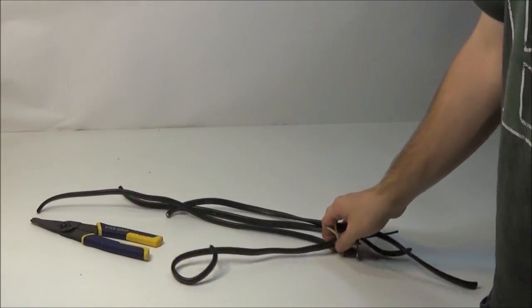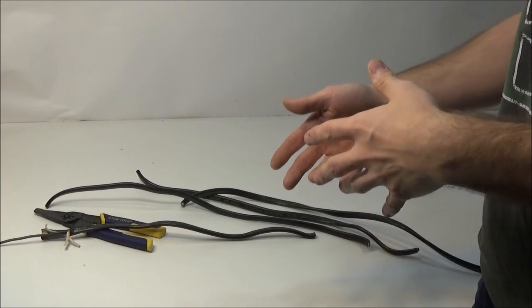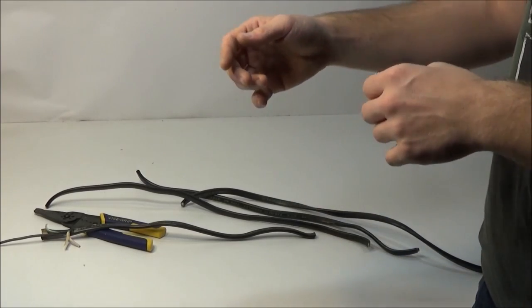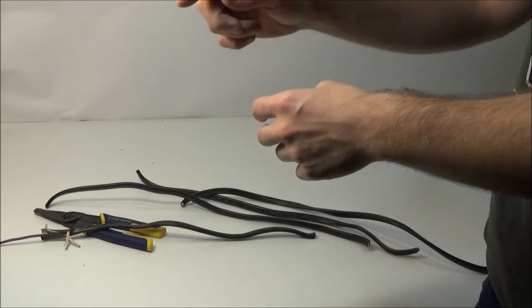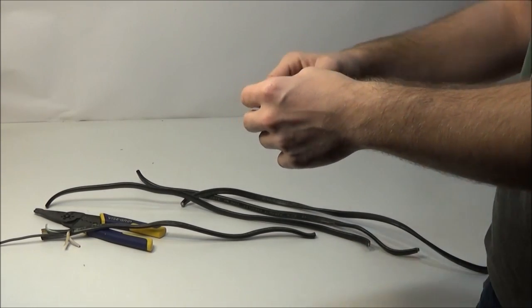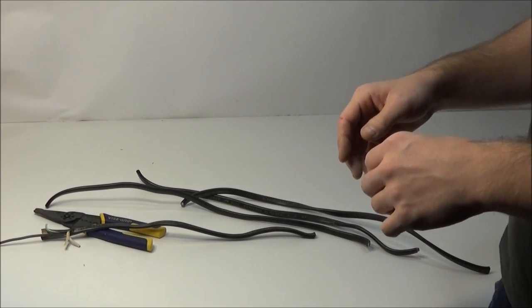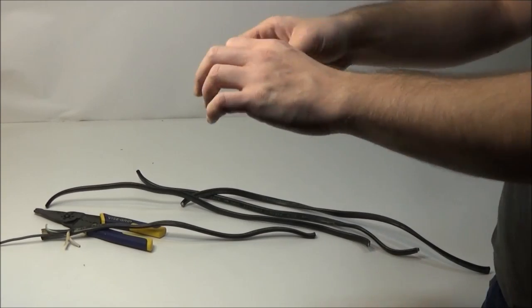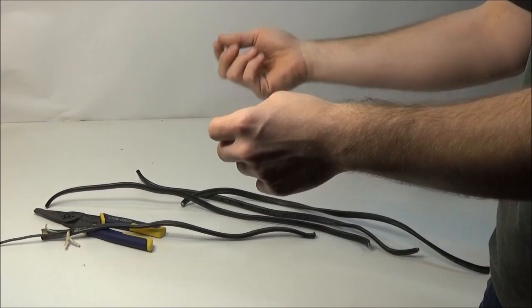Hey there YouTube. So yesterday I had to rewire a bunch of stuff. I was replacing switches and adding an outlet, and when they took the hot wire into the outlet box, the previous person had daisy-chained the switches using two wires under one screw. So I had to make a big pigtail and have wires leading out to the hot side of each switch.